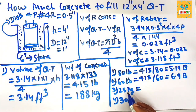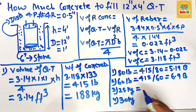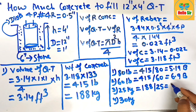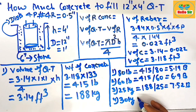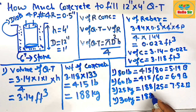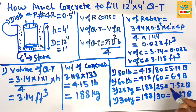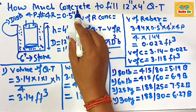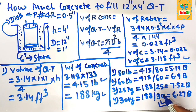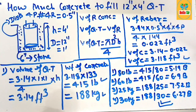If you calculate the number of 25 kg bags, divide the total weight of 188 kilograms by 25 kg, which gives about 7.52 bags. For 30-kilogram bags, divide by 30 and this gives about 6.27 bags. The required concrete amount is 3.118 cubic feet, 415 pounds or 188 kilograms, and the number of bags varies by size. Thank you.